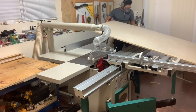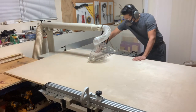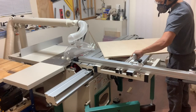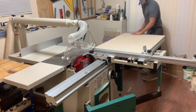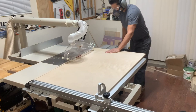First I'll get started by breaking down the plywood. I'll cut the sides of the carcasses, the bottoms, and the top and rear stretchers. You'll see me slide my rip fence back — I'll use that as a stop block, but moving it back behind the blade allows it to not bind. Once I have the pieces broken down into more manageable sizes I can trim them to their final dimensions. I'll also use the stop block on the crosscut fence to make repeatable cuts so everything is exactly the same.